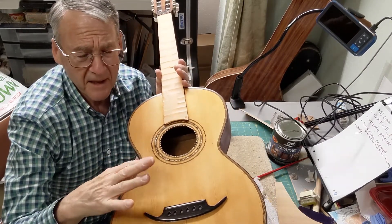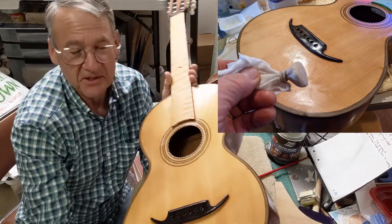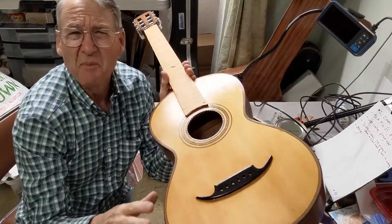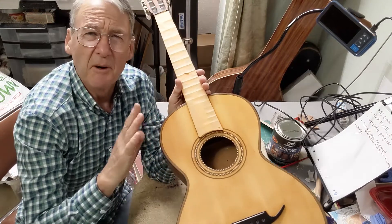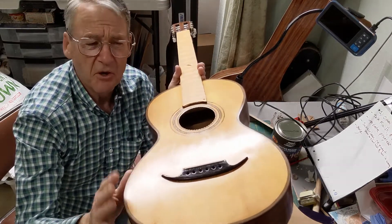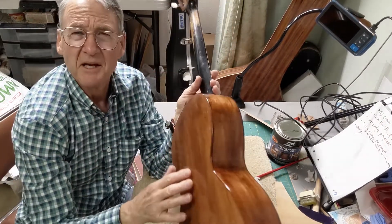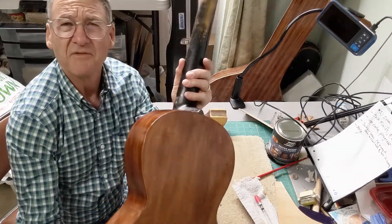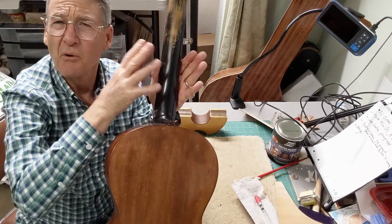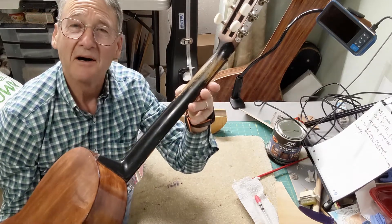For the top, since it's a French guitar, I decided to do a French polish. I know it's a little corny, but I'm French polishing the top. I'm struggling a little with it — there are some spots in the finish and it's not hardening up — but it's looking pretty good and coming along. French polish is basically shellac rubbed on. For the neck, I'll probably put on some water-based finish to clean it up and hold what's left of the 160-to-170-year-old paint.